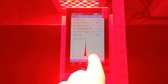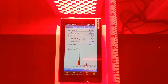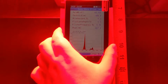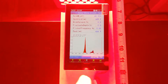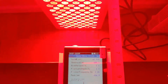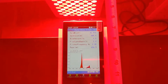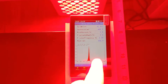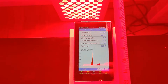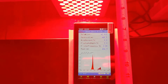That also explains why the solar power meter measurement is so much lower, because solar power meters really jump up when they're reading near-infrared — with that sensitivity curve I showed in my blog, the longer the wavelength, the more falsely high it reads. So if we're not lined up with near-infrared, and they're probably taking their measurements trying to line it up with the near-infrared to get an extra boost to their marketing, that's a problem. I can take a fresh measurement — you can see it's all legit: about 42, almost 43 milliwatts per centimeter squared. You get these really massive hot spots and low spots with not very good blending of wavelengths, even at six inches away.